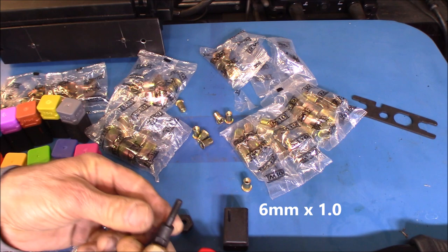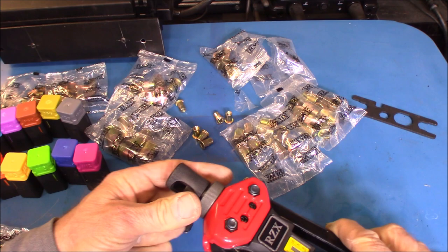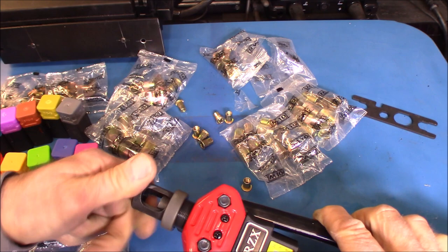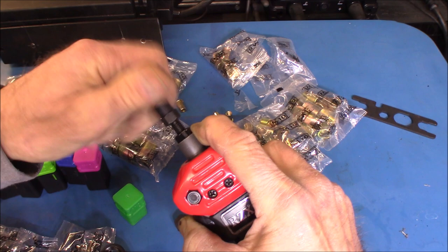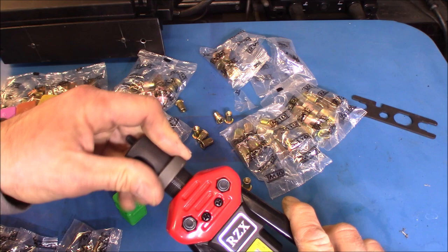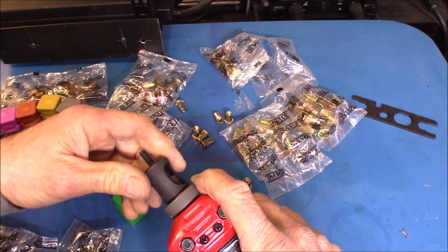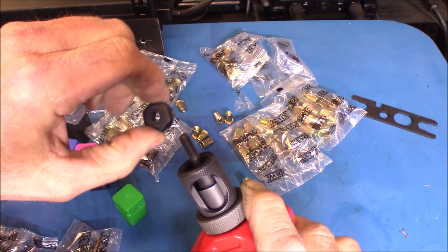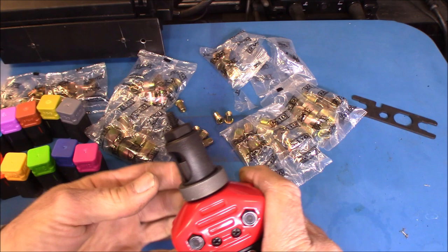For today we're going to use the M6. You have two parts here. First thing you want to do is spin this collar off, insert the die in here, and pull this collar down right here — just like that. Then reinsert the collar. This collar is the adjustment as far as how far it will crimp. Then add this collar piece right here to the top, just like that. Everything's finger tight — it'll work just fine.